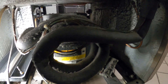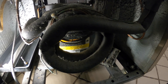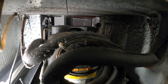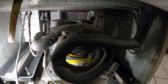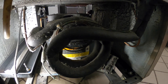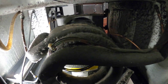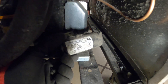I just hate when units are working sometimes and not working other times, and you're there when it's working — it makes it really tricky. But we're going to make use of this service call. It's a Saturday, they're about to have a wedding out here, and I need to pay my bills. The compressor started right away on that simulation. Alright, one thing I can check is the start capacitor — let's see what the ratings on this are.